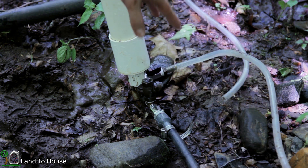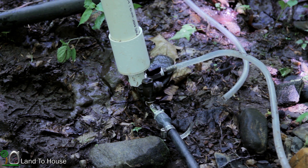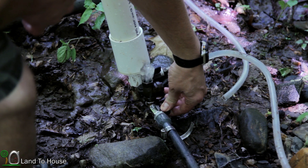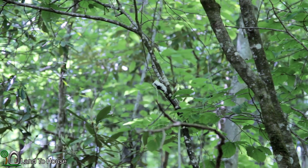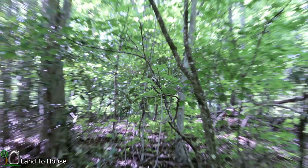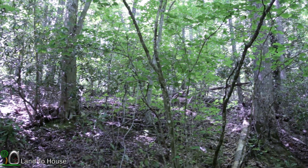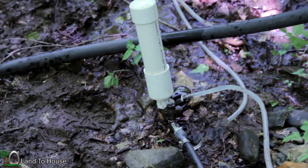I just ran the delivery pipe about 10 feet above the source, and we're operating on somewhere around four feet of head. So it's not quite the one-to-seven ratio I'm looking for, but let's give it a try. It's working here — let's take a look at the delivery pipe. The tiny 3/8 inch ram pump with a half inch drive pipe is able to operate and push water uphill very well, about 10 feet or so up the hill from the flume.